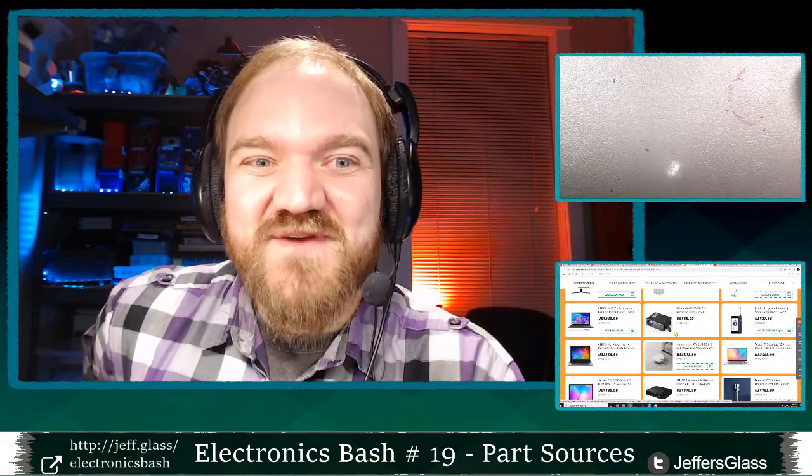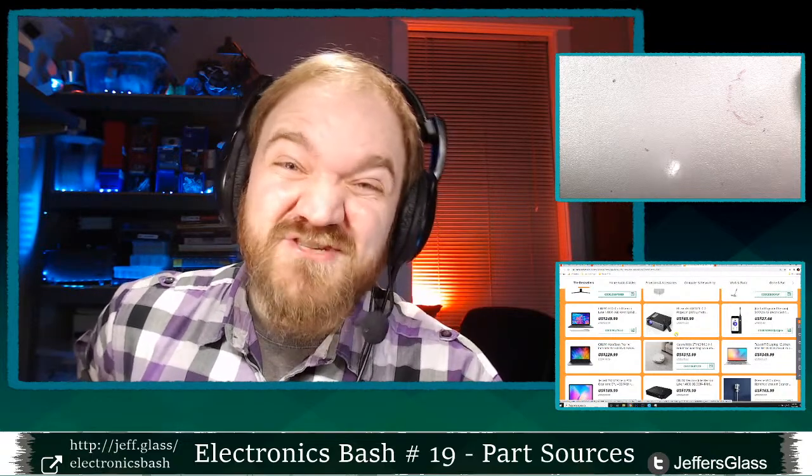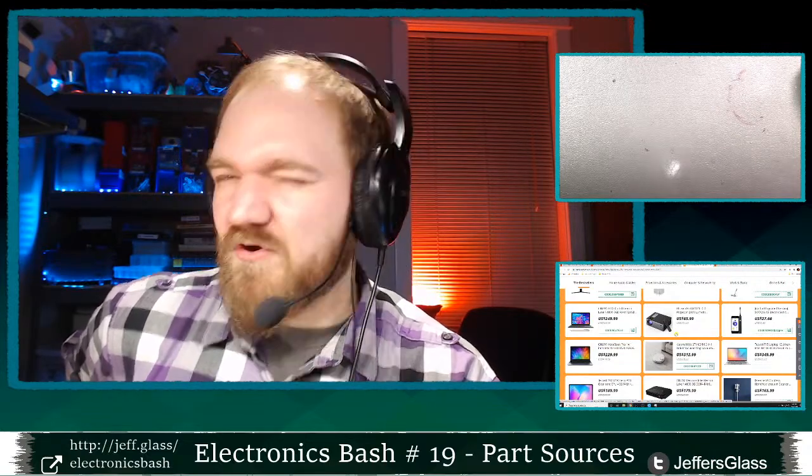Just looking up at my box of Arduinos there, when I was starting the Mini Moving Light project, I ordered a lot of 20 Arduino Pro Minis for like $22, knowing that there was some chance that none of them would work or be quite right. And what I've run into with those products specifically is that the power regulators on them are pretty crap. They will burn out spontaneously if you try to pull even half of what they are nominally rated for. There's some kind of off-brand power regulator and they go poof in smoke.